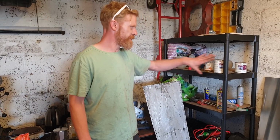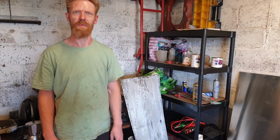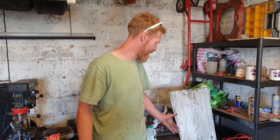Okay, well that's promising. So the thinking is that by going for the more rigid metal on the floor, you're actually adding significant structural rigidity to the overall shape of the chassis. And it's actually the glue, the aluminium to steel of the chassis connection that's doing the job. All the rivets are doing is protecting the glue. You will get a significant increase in overall torsional rigidity in the chassis for adding this floor instead of this floor. And it's all about the lightweights. Yes, well, it's all the same weight, but you might as well have the more expensive stuff that does an extra rigidity adding job for the same money and weight instead of the stuff that is a bit wibbly wobbly.